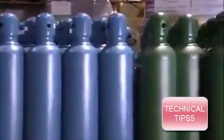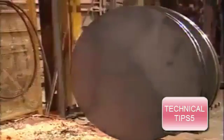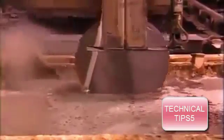These cylinders are made out of chrome moly, a steel alloy containing chromium and molybdenum. They start with discs that have already been heat-treated at 730 degrees Celsius for 36 hours. Now they go into the first of five hot chemical baths that will help the metal flex.